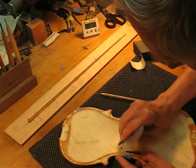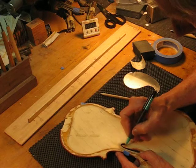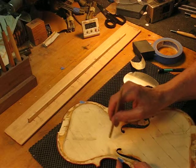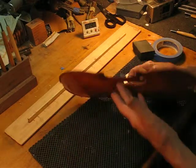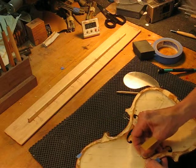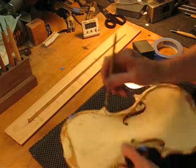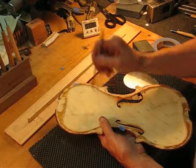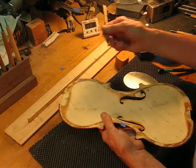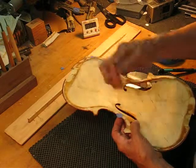It's getting down here pretty close — there's a high spot. I'm going to restore the line. Now this part actually belongs to this strip. It's a little bit higher here, so I'm going to support with my finger beneath and just sand that slightly — lower it down, get it in line with the goals we have. So we're about 168, and because we want to raise this whole strip up, the part attached to the center bout — we'll raise it on this end.